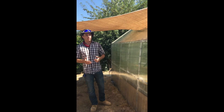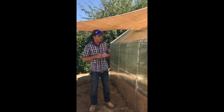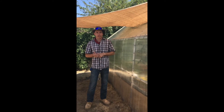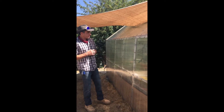Our greenhouses specifically have a lot of extra engineering, and we screw it off every six inches to help with the shear value, which is why our greenhouses are able to hold up to 130 mile an hour winds. So today we're just going to do a quick demonstration.